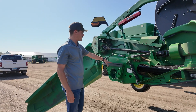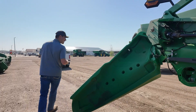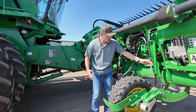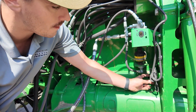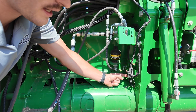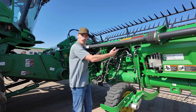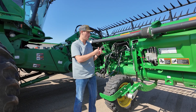The indicator on the newer headers for this actuator to be pulled in and release that cutter bar is over on your right inner gauge wheel. Right on the inside there's a sensor. What happens is when this gauge wheel pulls up, it'll pull this down and push this end up — it'll click. That click is our indicator to the controller that we're now going to be doing on-ground cutting. It'll also release the cutter bar, given we already have those prerequisites of dropping the plate and the pin pulled on the outside.